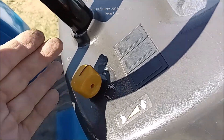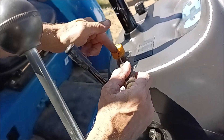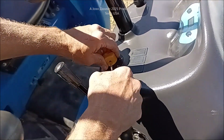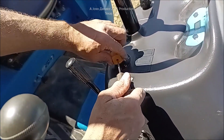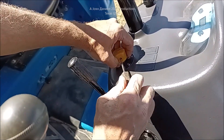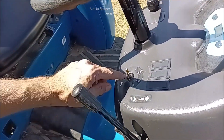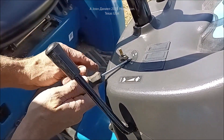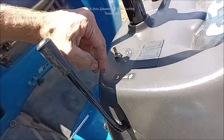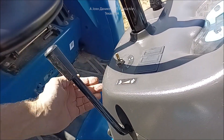Practically, only replacing the switch with a pair of toggle switches is actually a permanent cure, but let me show you what is a long-term cure. So what I got here — I'm going to give you an idea of the design of this switch and what goes on with it. You have a standard screw right here on the side, you pull it out until you kind of hear a back click with the threads. Don't lose your screw. Now, right here you'll notice how this pushes back and forth. There is a spring with a contact to ground of the chassis of this switch. The switch is isolated — it's not mounted to any metal, it's in plastic. All of them are the same; some of them will have them down here, but the rain and moisture still gets to them.